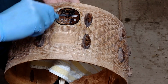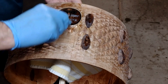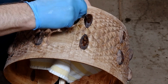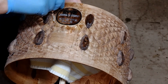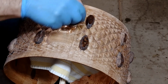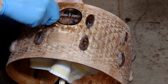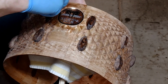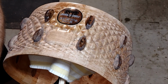This is not the first coat of finish I've put on the outside of the drum. At this point, I think I've done 4 coats, and I sand between after every 2, get it nice and smooth. Myrtle wood is temperamental, trying to get a good finish. The first layers absorb quite a bit, and it raises the grain a little bit, even though I raise the grain with water ahead of time and sand. It's just a little bit temperamental. It takes a lot of work to get a good finish on it. I'm curious if spraying a finish might help, but I don't think it would.